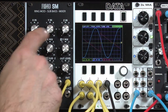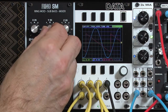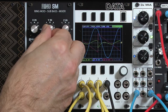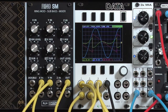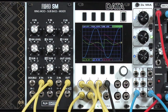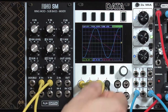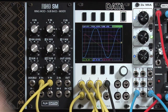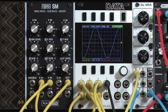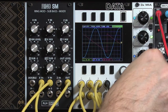As I bring up the Y input, the X and Y inputs for the ring modulator will be multiplied together. You can see the resulting green waveform. And actually to show this a bit more clearly, because it is phase inverted right now, excuse me while I take the output and run it through an inverter — and you can really see on the scope how that pink waveform is having its level multiplied by the blue wave, the X and Y inputs, to result in the green wave.